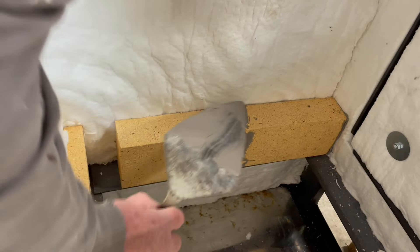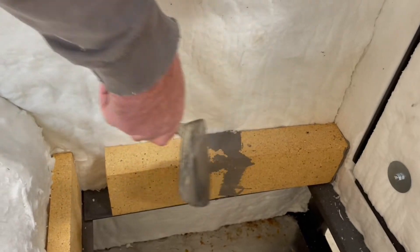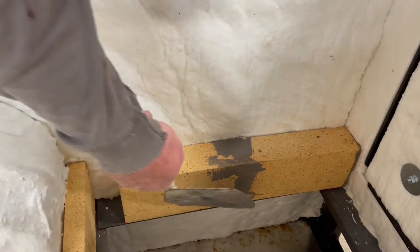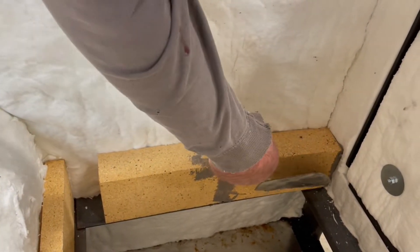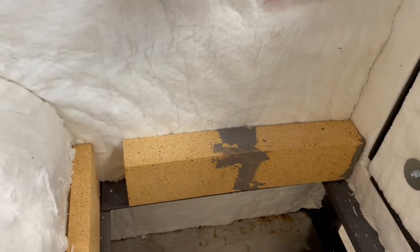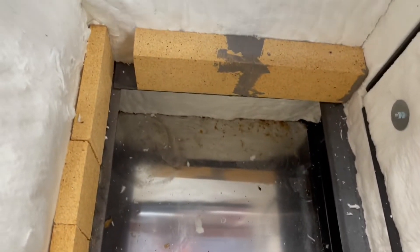Little gaps are okay, and that's going to help hold it together. It doesn't have to look pretty. It's about an eighth-inch mud joint. I did put some on the end there, probably didn't have to. About an eighth-inch mud joint - you can see down at the other side there. That's about what you want to do, just the ends of the brick as they go together.